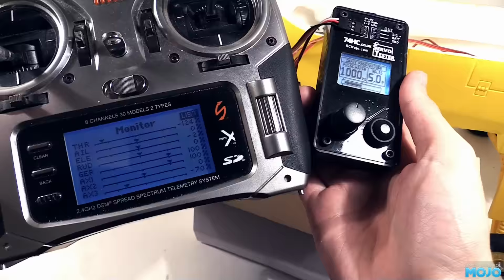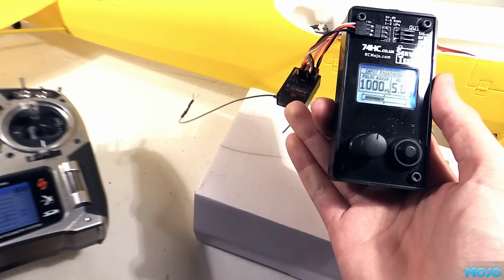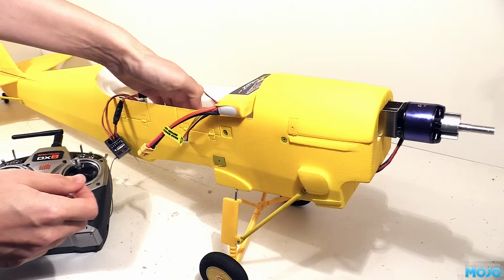It's not just Spektrum that does this. Every computer radio I've used does something similar. Futaba, JR, they all do something pretty similar. Part of the problem is they use an arbitrary scale that doesn't actually relate to anything. The only exception I've come across is in the OpenTX firmware that allows you to use microseconds in the menus. Anyway, I could rant on about such things all day, but that's not going to get the Tiger Moth built.